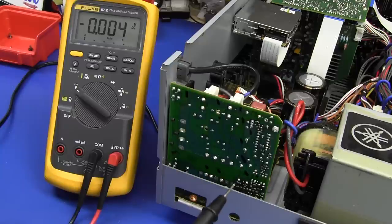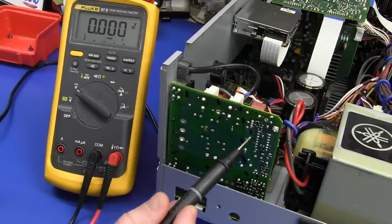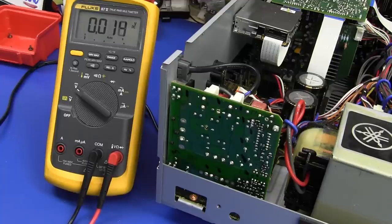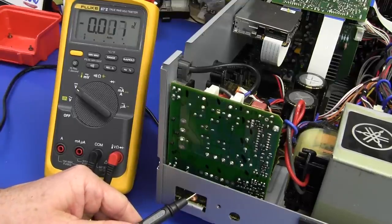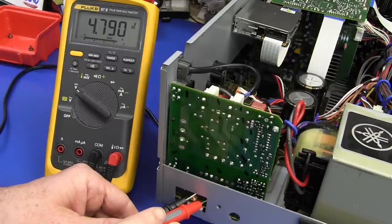Have we got some sort of filter cap issue in there? Curiously on the board I can see black texture marks - it's almost as if somebody's been checking off test points. There's a number 3 written there. But I see similar marks on all the other boards too, so I think it's just some sort of factory test marking. Now I can see a point marked 'plus 5 volts S' - probably standby - and probing that I get 4.79 volts. That's within 5% spec, though technically suspiciously low.